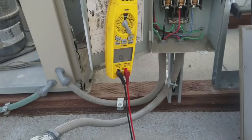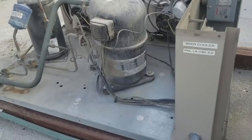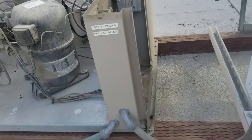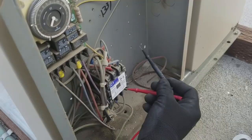I'm not just going to replace that fuse before going any further. I'm going to find where that line voltage goes. I always try to tell people — yeah, we can throw a fuse in and see if it blows again — but I'd rather test the compressor to make sure it's not grounded out, and test the condenser fan motors. The quick way is to go to the load side of the contactor and test each load leg to ground.